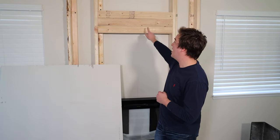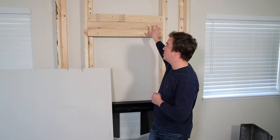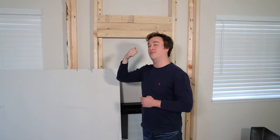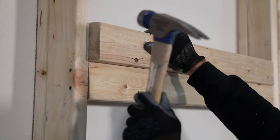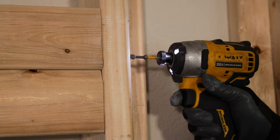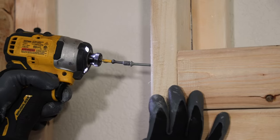If you're thinking to yourself that you might want to put like a TV or something that you want to hang on this frame, definitely keep in mind to put some wood up there into your frame so you have the ability to do that. And then also measure down from your ceiling so you know where that is once everything's installed. We've inserted 3 more 32-inch cross members above the fireplace to give us a place to attach the TV at a later time.